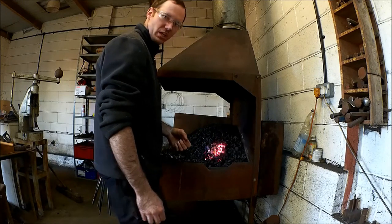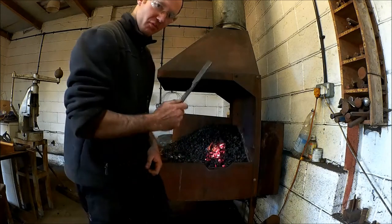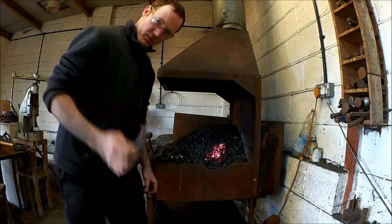There's enough heat in there for the piece to absorb. Check it when you're ready. Take it out, start working it. But before you start working it, whack it up again. If the fire's getting back up to temperature, getting that core nice and hot, you need to put your steel back in again.